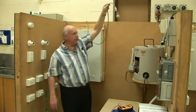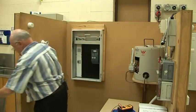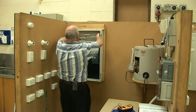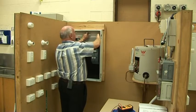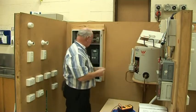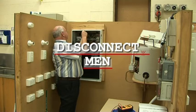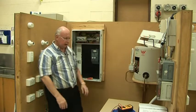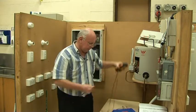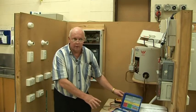Because there's my consumer's mains. So if I just get myself organised here — what I'm going to do is start from the very beginning again with what we started discussing upstairs. The first thing I'm going to do is the MEN point. So I'll just lift one end of that out, disconnect it. And as I said, going right from the very beginning, we'll go through the meter setup. So I'm selecting the correct meter here — a low reading ohm meter.